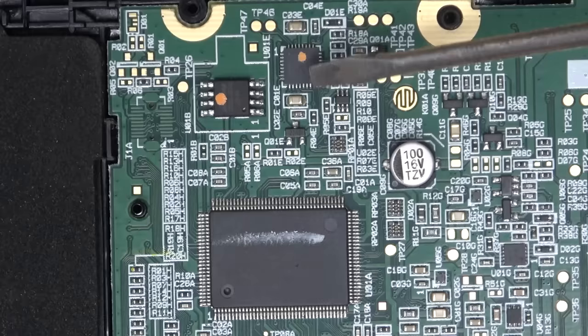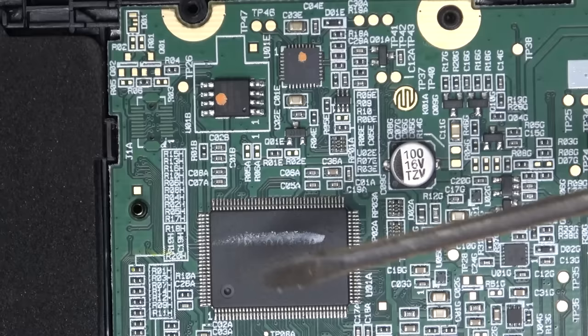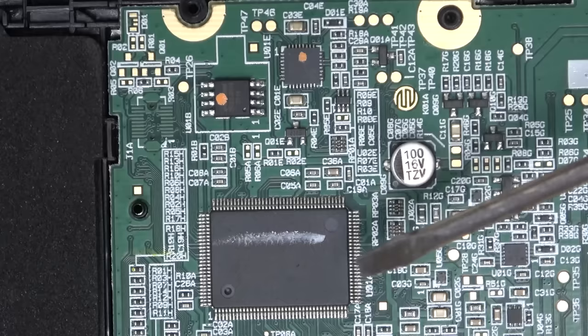That's probably handled by the main chip. So yeah, this is a Z80 Acclaim. So it actually is a Z80 compatible core, so they can use all their old code from like 30 years ago. But then it has access to modern peripherals such as SPI, I2C, also USB.